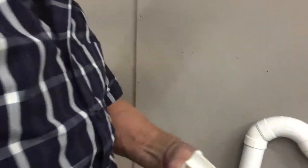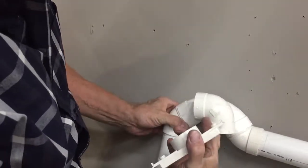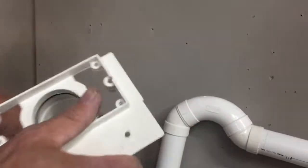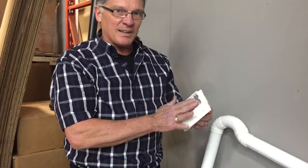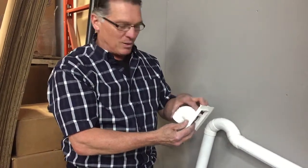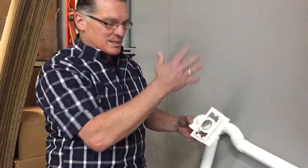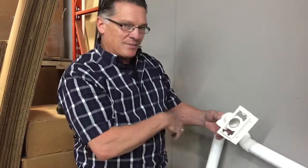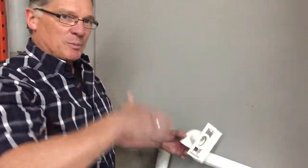The only spot you're ever going to use a short 90 like this, instead of a long 90 like that, is at the inlet. There's a reason for that. If anything is going to get plugged in your system, you want it to get plugged here at the inlet where it's easy to get a hold of it. So if anything inadvertently gets sucked in there, this is where you want it to get caught. So this is where you put the tightest elbow in your entire system. If something too big to go through the whole system gets in here, it's going to get caught right here where you have access to it to grab it. Every other port after that, you use long elbows so that you start off tighter here, and throughout the rest of the system, it's less tight. It's more open, more gentle curves.